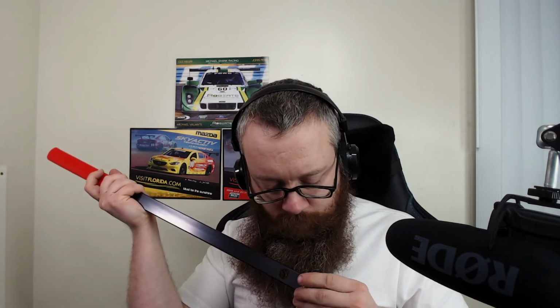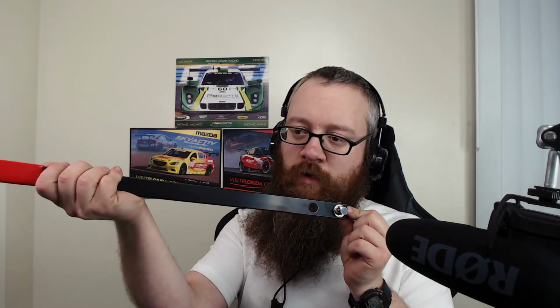I was really hoping for that on this one, because I've seen some of the cheaper rental tools the parts stores have. They have a little square drive coming out of the end of the bar, and I've seen the holes on the backside round out and cause those to become loose. Here, you're not going to have a whole lot of play, so once you get on whatever you're trying to loosen with this, it isn't going to move around on you. It's going to stay in place. And with the ball in place, it's not easy to fall out either. If you need to put a socket on, they have a lock on the end of the square drives here as well. So there's that.